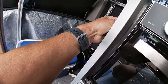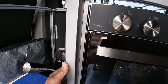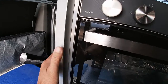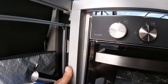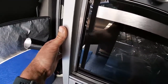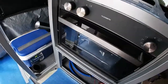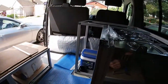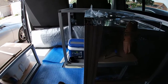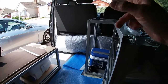I've got a bit of aluminium angle and what I'm going to do is fix that to the extrusion at the back and then in the sides. As it comes through the oven side I can just fix it in — I'll probably drill and tap it so I prefer to make a really solid fixing. That side's not a problem, but then the other side is a problem. This side has a double thickness piece of aluminium on it so you can't put the angle iron like you do on the other side.